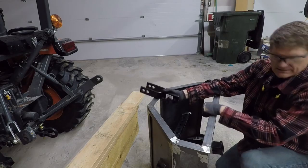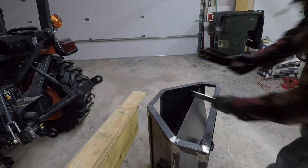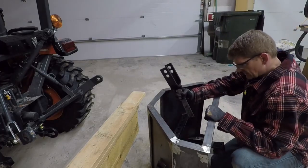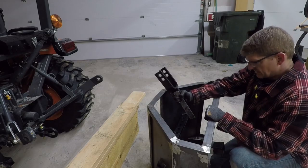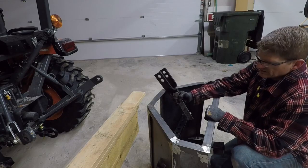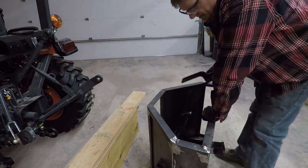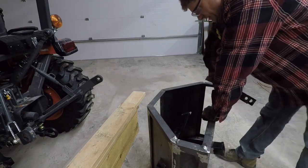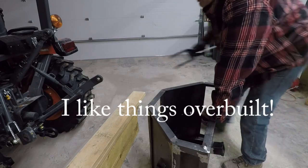But then I'm going to weld a couple of pieces of flat bar onto here, and that flat bar is going to go all the way down and get welded into the T created by the hitch and the drawbar. I'm probably going to get this welded directly to the hitch tube, so I'm going to have multiple connections of steel here. Between that and probably some cross braces coming off the 3-point drawbar down to the bottom, I'm going to run maybe 2, maybe 4 pieces down to the bottom frame from that drawbar.